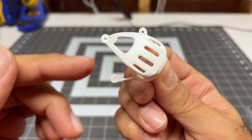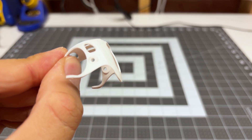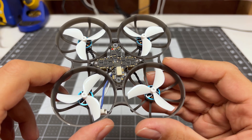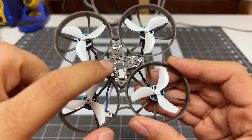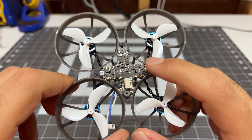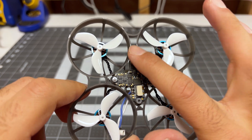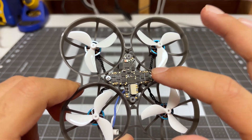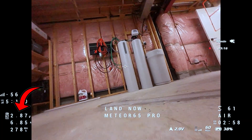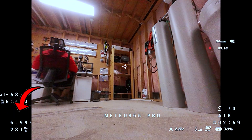Here's the canopy they provide. Interestingly enough, there are only three mounting holes — the front actually does not have a mounting screw. Looking closer at the quad, this board is what really stands out, designed specifically for the O4 Lite Air Unit. It has some really interesting ways of raising the battery voltage so that we're able to run our O4 Lite Air Unit reliably on a one-cell battery. That was a big issue at launch time with the O4 Air Unit.